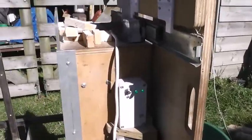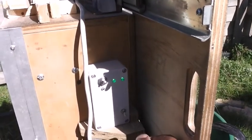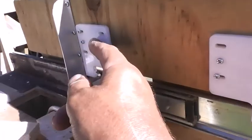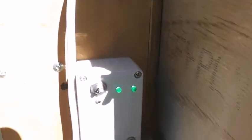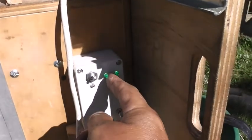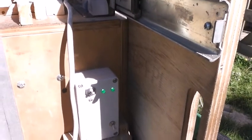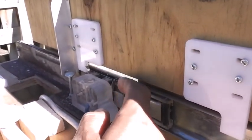What I've done is I've made up a little computer here that registers the position of the slide. We have a couple of micro switches and a couple of stops here that travel on the slide. When the slide reaches its limits, the other switch works these two LEDs as a diagnostic in case something goes wrong. I've noticed that even though these switches are brand spanky new, they're filthy.